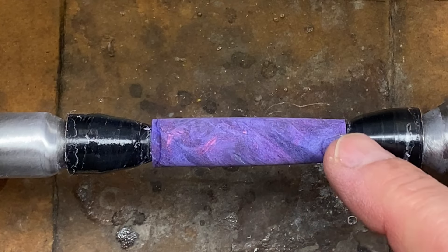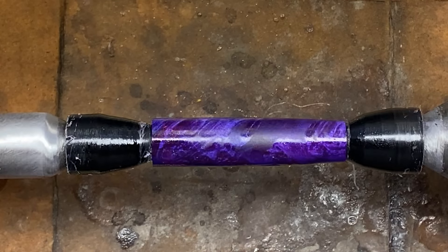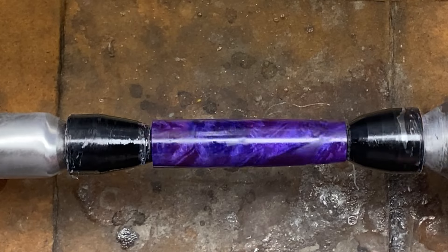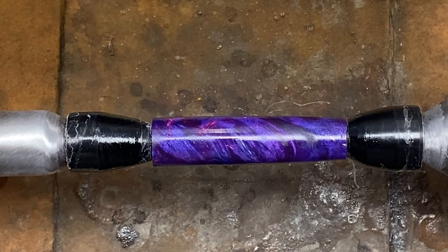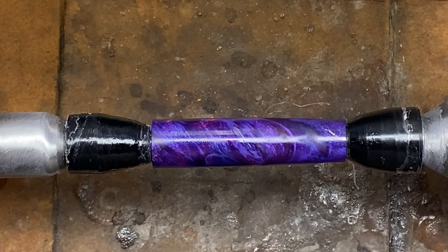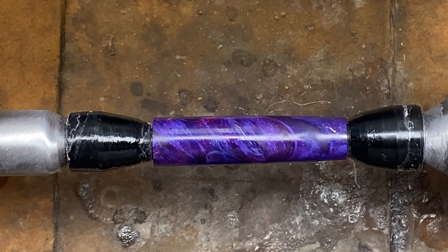Let's have a before and after. You can see down here there's a little line — that's CA glue where I glued the piece in. I'm going to go ahead and give it the first coat of thin CA. I'm going to shut this lathe off and look at that — you cannot see the difference because the CA basically blends with the CA and it totally disappears. Right there — I can see a little bit of brass tube. That's a bummer. I'm going to go ahead and finish this blank, but I don't know that I'm going to press this into a kit because honestly, that's not something that I would consider selling or giving away. I think I'm just going to go ahead and stop on this blank. Sometimes you just have to cut your losses. I hate it because I thought for sure I had this fixed, but I think that's going to be it for this blank. I'm going to put this one away and start on another one.